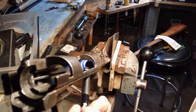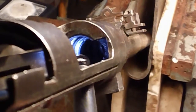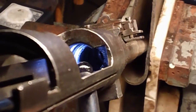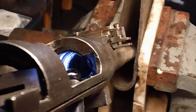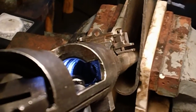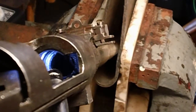Alright, here we go with a really good close look at that chamber. It's got some real bad cuts in it — looks like somebody took a drill bit to it, or a chamber reamer that had a lot of chips in it. It really scarred it up good in there. My opinion is I would probably just re-barrel this rifle, but we're gonna go ahead and cast the chamber to get a better look and find out what they tried to chamber this rifle to, because it was originally 7.7 Jap.